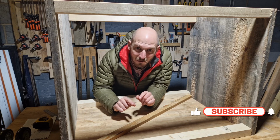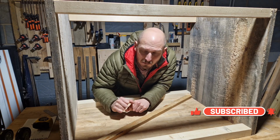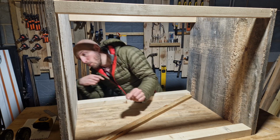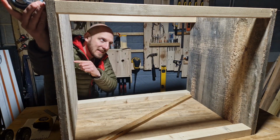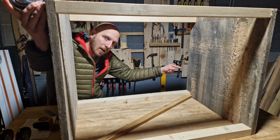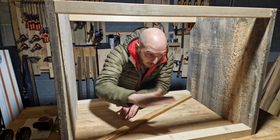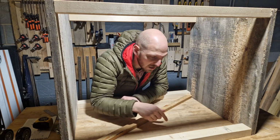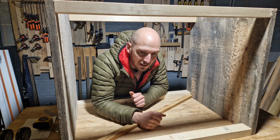Hello. So this is the next day. I had to sleep on this one last night. I've got the height absolutely perfect. I've got these castors that are going to go on the bottom, and with the castors and the thicknesser on top, the outfeed tray of the thicknesser will be the same height as this, so I can use this as an outfeed table because I don't want a big cart.